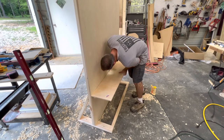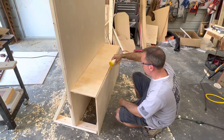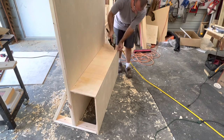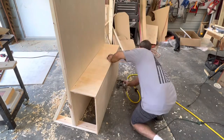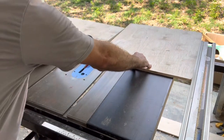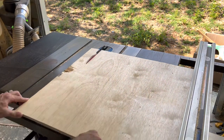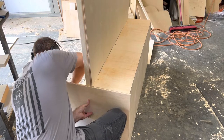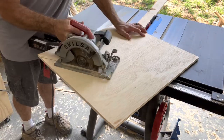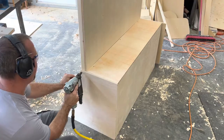You want to put your screws or nails as close to the wall as possible so your trim will cover them up. Put a couple screws and a couple of brad nails to hold it up. For the bottom piece, put glue on top of the bottom so when you slide it in the glue squeezes together, and put a little glue on the bottom part to glue onto that scrap piece. Put a couple brad nails around it and you're good to go. Set up your table saw for the side pieces — refer to the plans for the lengths. You can take the square over to the wall, put it up against it, mark along the angled two-by-four, then take your circular saw and run down the line.